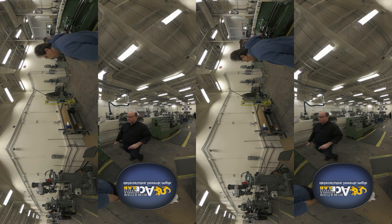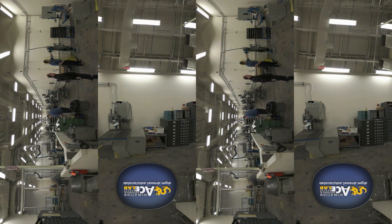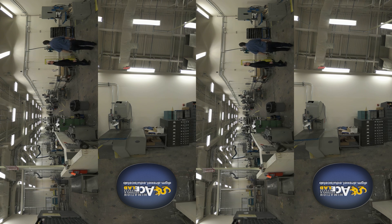Farther into the shop we have a couple more work areas. We have what's called an arbor press. You'll see these on Harbor Freight and they're hydraulic, but this one is completely manual — it has a high and low speed. If you had two parts pressed together, this will push them apart. We also have a little one for smaller pins, bearings, or if we're making a pocket. You can also drive a broach through a hole with this. You start out with a round hole, and as the broach comes down on an angle it slots out the hole, and you end up with square corners in that hole.